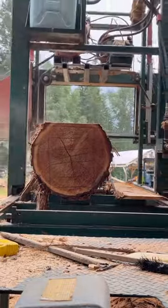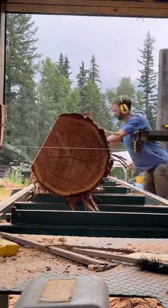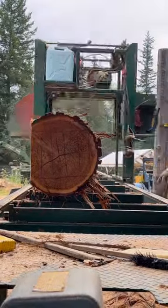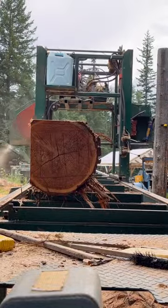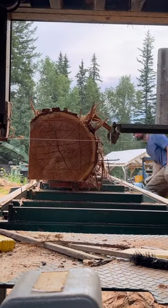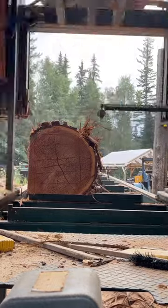When I'm milling high value timbers it's always best to use the lion stalking a zebra in the Serengeti principle and just sneak up on it. So I'm going to gradually work my way towards that 12x12 that I want, and I'm going to pull one and two inch off of it and just stash that for now like a squirrel, and gradually I will work my way towards a shape and size that I'm happy with.